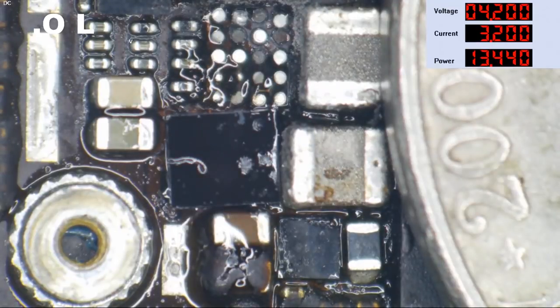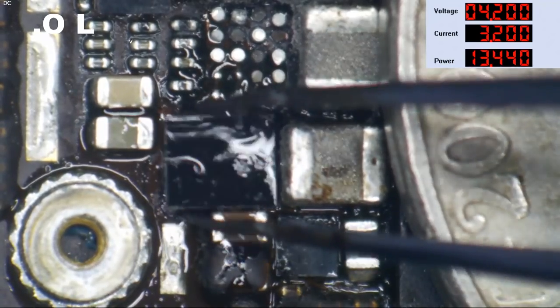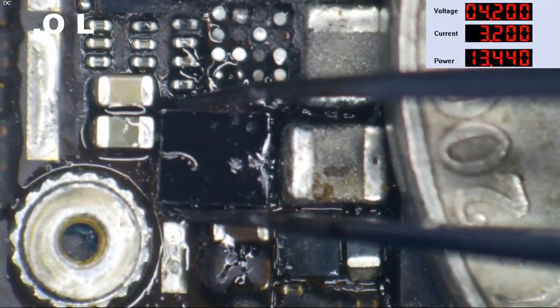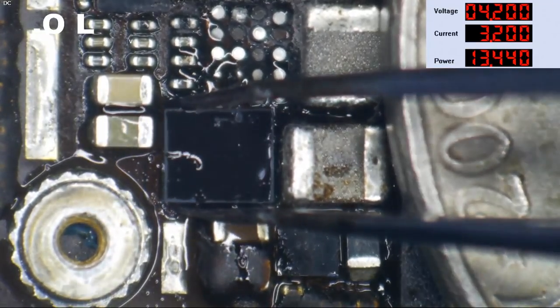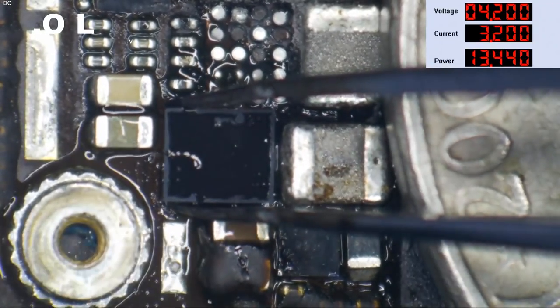Airflow feels a little high. Yeah, it is a little high. I'm on the wrong channel. There we go. Right now I'm set to 430C at an airflow of 40. Okay, let's get a good look at where all of our balls are, and get a good feel of how these balls are lining up. Now since I switched this to leaded, this will be a lot easier.